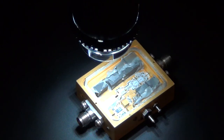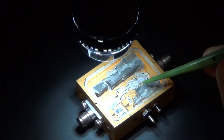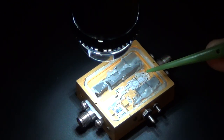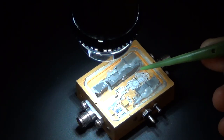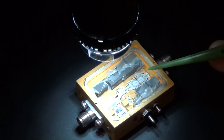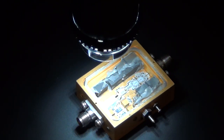So the RF absorbers were right there. And it's also very interesting to note, as I was saying before, and this verifies what I was mentioning as well, that the RF absorbers were all concentrated in this region. This is the output portion where the big PA is, and I'll show you how that PA construction is. This is quite beautiful actually to look at, and the microscope does an amazing job revealing the detail. So you can see there's so much to learn by looking at this. If you haven't seen these types of circuits, just by having a microscope that can reveal the details in here.